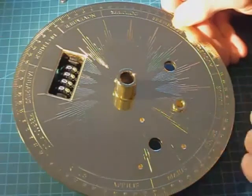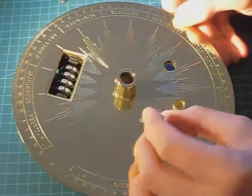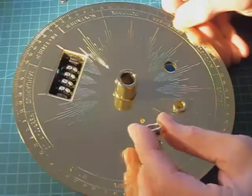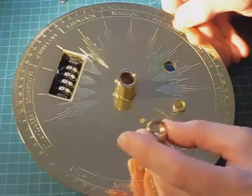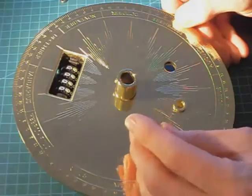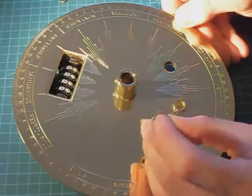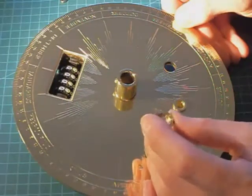The solution is to lock the bushes in place with a small brass collar fitted with a grub screw — an M3x3 grub screw. The collars have been drilled slightly oversize because there is variation in the taper and thickness of the various bushes. In this case, I've put a small amount of shim inside the collar just to take up any slack.